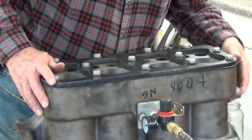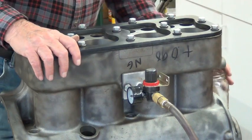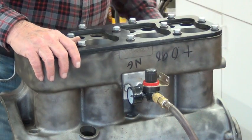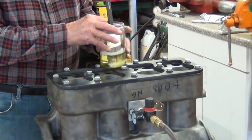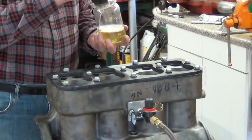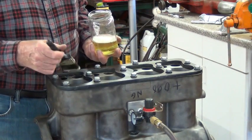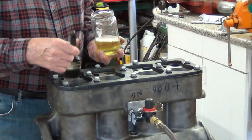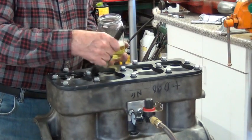What we'll do is put air pressure in it, about 30 pounds or so. It's the same as a man checking for gas leaks in your home. You just take soapy water and run it around all the surfaces that you want to check and see if you see any bubbles coming out. So that's what we're doing now.